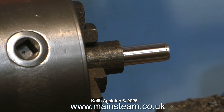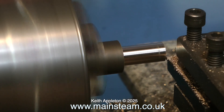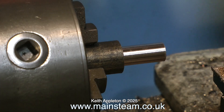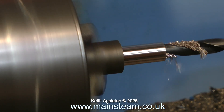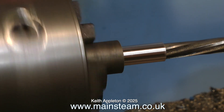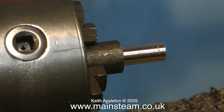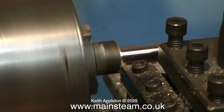I do not want this to be an interference fit. If it's an interference fit — a tight fit — I'll have to press it into the beam, and what will happen is the hole in the bush will get smaller because it's been compressed. So I'm doing this all in one process: center drill first, then open up the hole using a drill one imperial size less than the final size, then use a three-eighths of an inch reamer to finally size the hole.